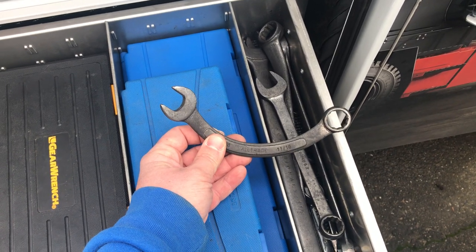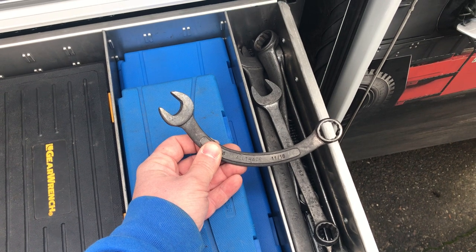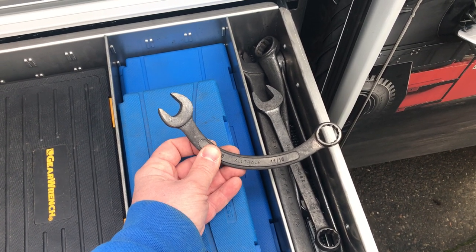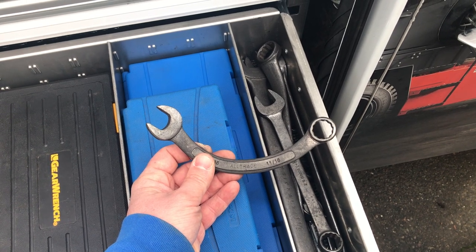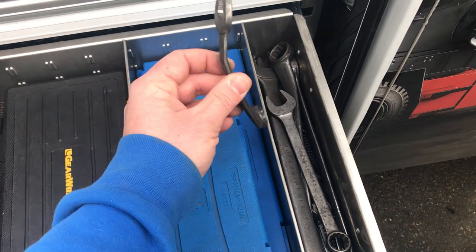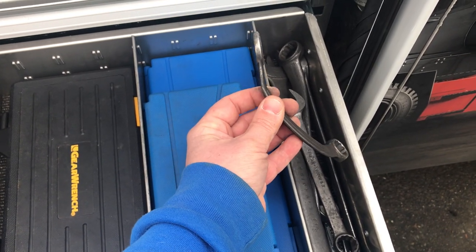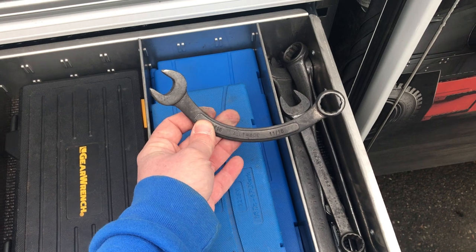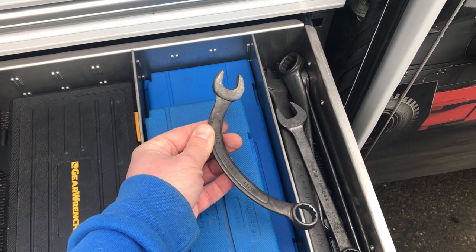I was doing a rebuild on a Cummins K19 in the shop, and pulling the injection pump off of the front cover, and there just wasn't really any way to get in there and take the nuts off of the studs. So I got creative with the torch and kicked the head over a little bit, and then gave it a half moon, and Bob's your uncle, the injection pump come off. So that worked out pretty good.